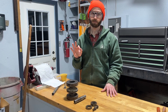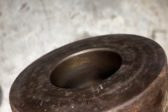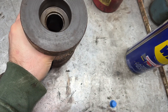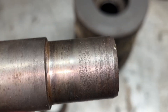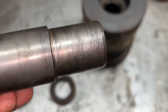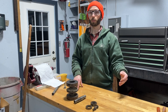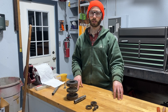I have three reasons why. The first is part condition. When I cleaned up the parts, the outer body of the roller especially was in pretty good shape — minimal damage, minimal pitting, just a little bit of wear on the outside. But the bushing, the inner piece, actually had a fair amount of pitting right where the seal would ride. So if I were to reassemble this with new bearings and seals, it would not last as long as it did originally, because the seal essentially could not function properly — it did not have a smooth surface to seal against.